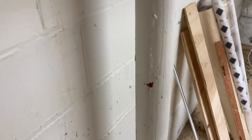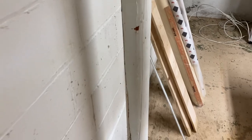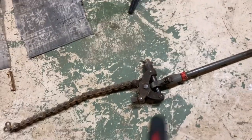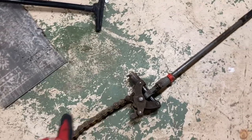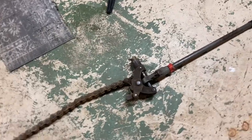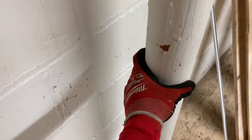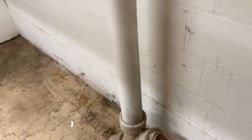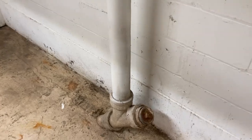Because we have so much clearance between the cast iron and the wall, there's really no reason to wreck an expensive carbide tooth sawzall blade. So we're going to use our rigid cast iron snapper. Basically the chain has wheels in it similar to a tubing cutter — just a bunch of them — and they squeeze the pipe as you ratchet the handle. Ideally, if the cast iron is in decent shape, there'll be a nice clean break on there. That'll save a lot of aggravation because I won't have to say a lot of curse words using the sawzall because it takes so long to cut.